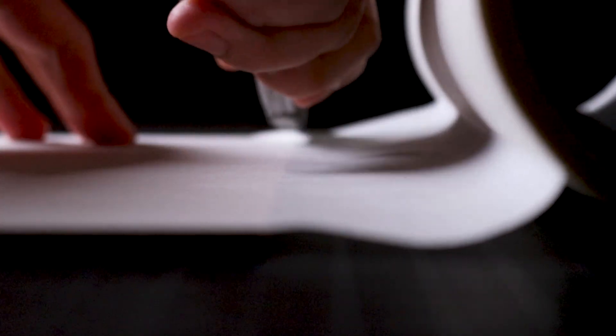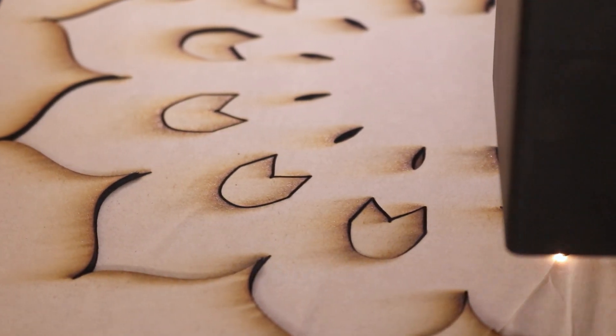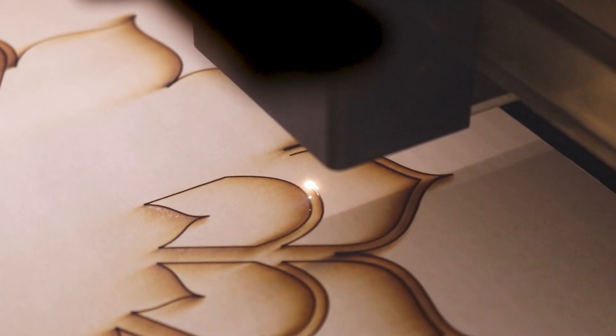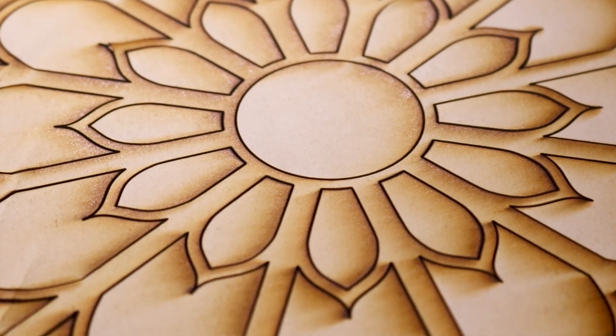I apply paper masking tape to protect the maple plywood from the laser. I'll also be using mahogany plywood and blue acrylic to create depth and add color. I insert the blue acrylic and start laser cutting. I love watching the laser cut the outline of the flower with the subtle curves of each petal. It took 2 minutes to cut the base layer from the blue acrylic and 13 minutes for each wood layer — about 40 minutes total on my Glowforge laser cutter.